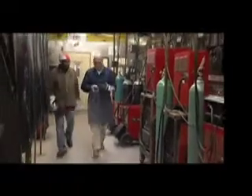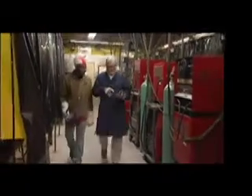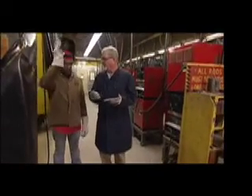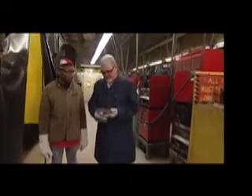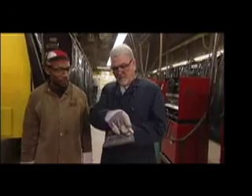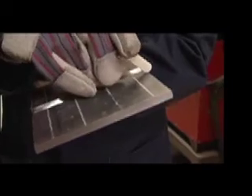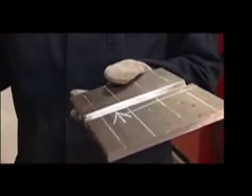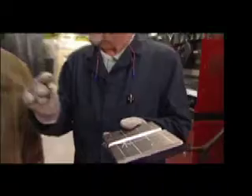This is your test assembly for the shielded metal arc welding. There are two stop/starts required, and two methods of doing them — both are acceptable. The method we're doing today: you'll make a start on the square side, go left to right, and make a stop right here on the fillet weld side. Keep the fillet weld maximum 8mm, equal leg.